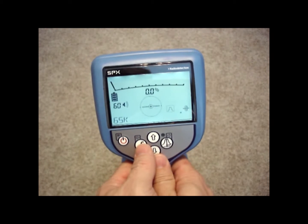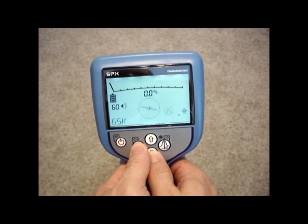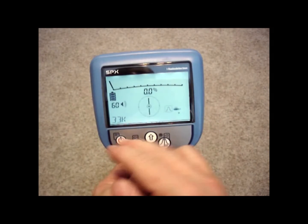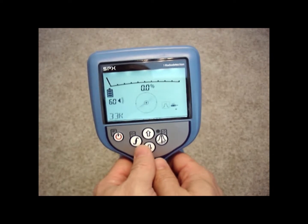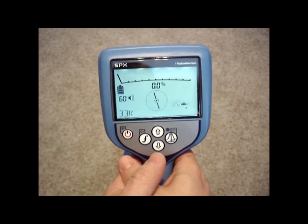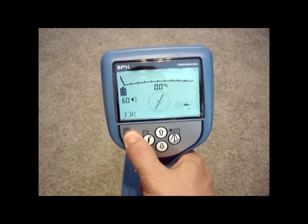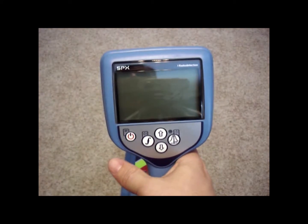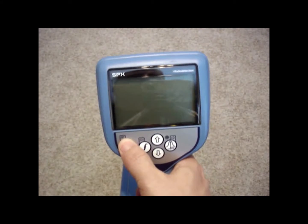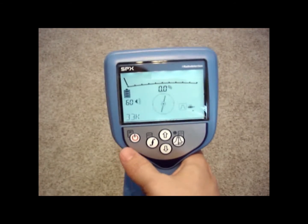If you're a company that never plans on using a sewer sonde, we can take off all those sonde modes so they don't show up on the regular screen. You do that by going into the menu system. The menu system is accessed with the on-off key. If the on-off key is held down it will shut the unit off, but if you just push it quickly, you will go into a menu where you can control a lot of the options.